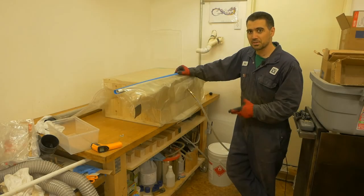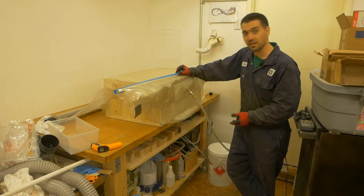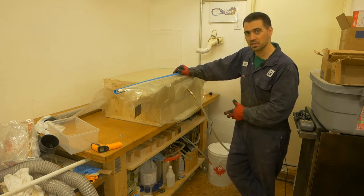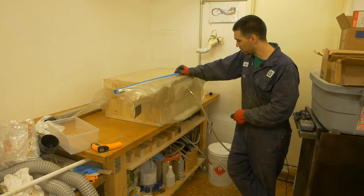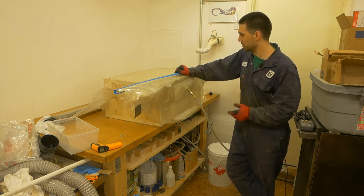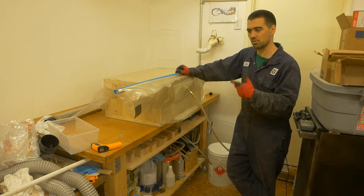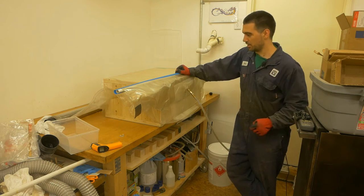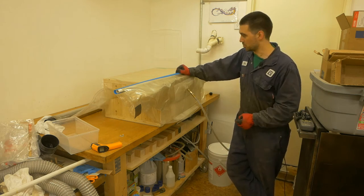So after about 10 minutes of sucking, air that is, vacuum is created and it's holding steadily at 23 inches of mercury. Of course, when I am doing the oil bath, I will run the pump continuously just to get constant air movement from the bag to the pump, and that will get all the air out of the wood as well.